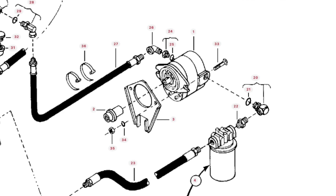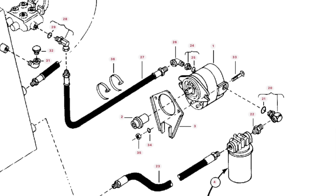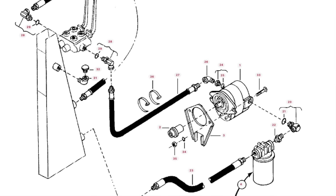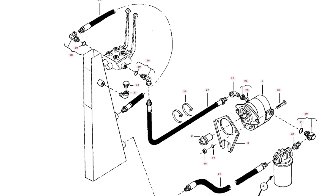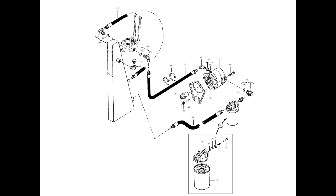On a Massey 231 you could put a PTO pump on it. A PTO pump is a hydraulic pump that mounts on the back on the PTO. The front-end loaders we sold from Massey actually had a hydraulic oil sump built into the loader arms — you loaded that up with oil, put your PTO pump on, and it had a filter built into the system to run the loader. You could use your three-point with bales and your loader at the same time with no problem, and you had much more flow — many were 10 gallons per minute or more, which is plenty fast on a loader.